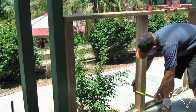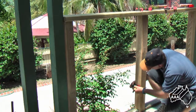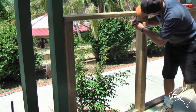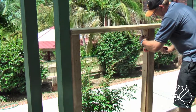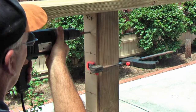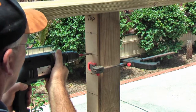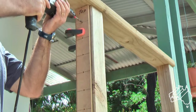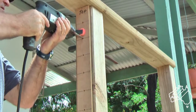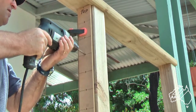For drilling the intermediate posts, first measure the center of the post so the drilling template can be clamped correctly into position. Please note if using pre-swaged wires, a 7.5 millimeter drill hole will be required to allow the wire stud end of the rigging screw to pass through. If you intend to use split grommets you will need to drill with a 9 millimeter drill bit to accommodate the 9 millimeter diameter grommets. We always recommend drilling your intermediates just past halfway and then relocating the drilling template on the other side of the intermediate post. Once you have relocated the drilling template, continue to drill your post till the hole runs all the way through the intermediate, ready for the wire to be passed through.